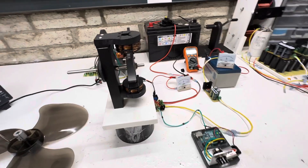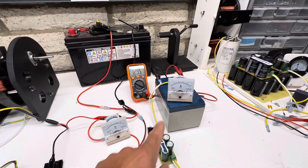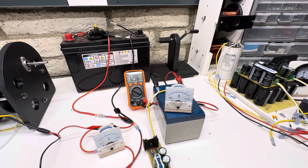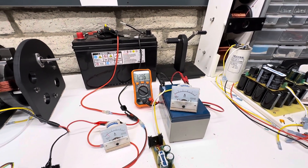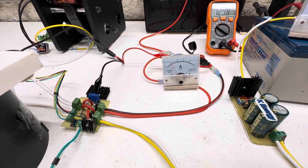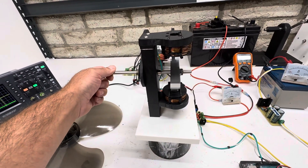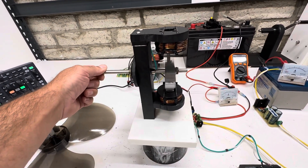That's a pretty good amount of torque. We're using about three-quarters of an amp right now, and you can see the output dumping right here — the battery's coming up. As I load it up a little bit, it goes a little over an amp but it really starts thumping. There's a lot of traction force on this motor.